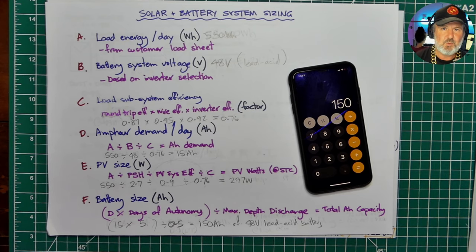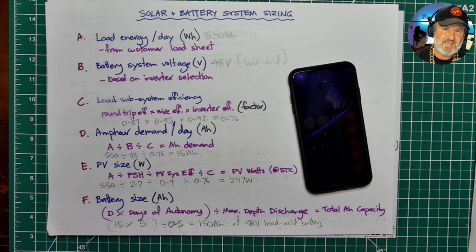Also, one of the secret benefits of solar panels is they cool. They keep the sun off your roof. In terms of thermal load on a building, they completely block the direct solar radiation. So there's a lot to be said for oversizing for both energy and for cooling benefits.